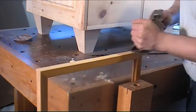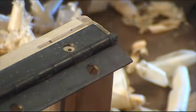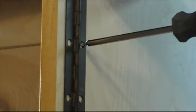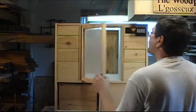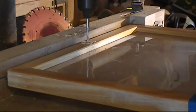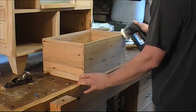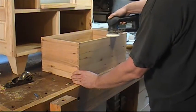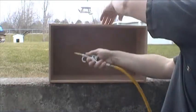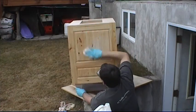I plane the door with the hinges so it will close without catching. I drill holes on the door and inside the cabinet for the hinge screws. I punch a hole for the door handle and I drill it. I sand all the sharp corners of all the drawers and the cabinet as well. I vacuum all the dust that I can, then I blow compressed air to remove the rest. I clean everything with mineral spirits.